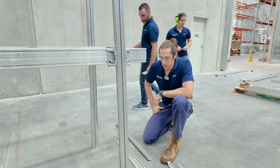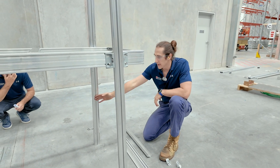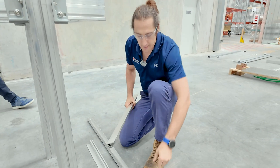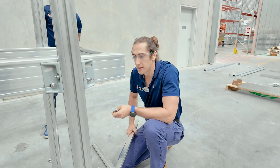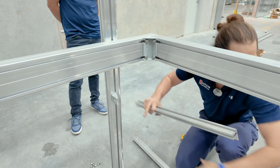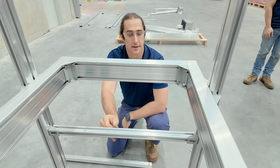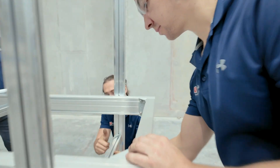The next step is to build the support structure that braces the two posts together so that we get rigidity of the platform in this orientation. We're using the same profile as the mesh support and again using an E-bracket to hold it in place. These get hooked into the legs on either side, and we put the aluminium piece between those two sides, fixed in place with a T-bolt on each side.